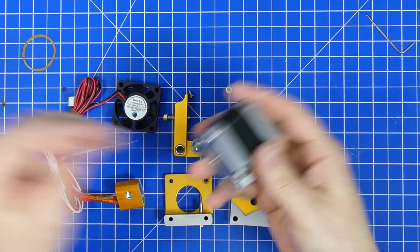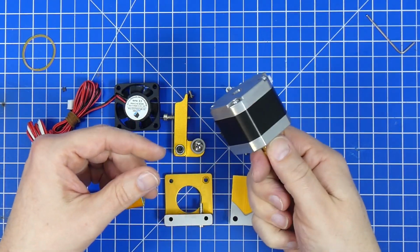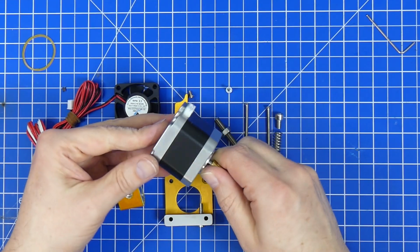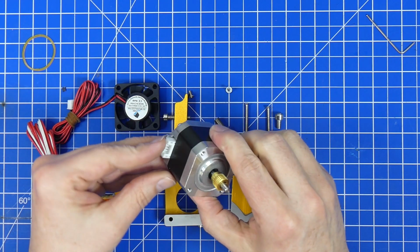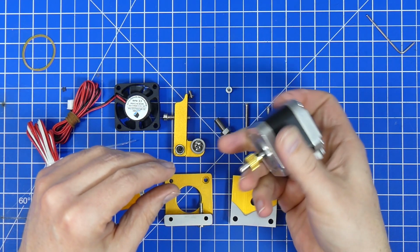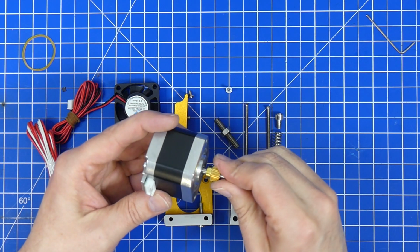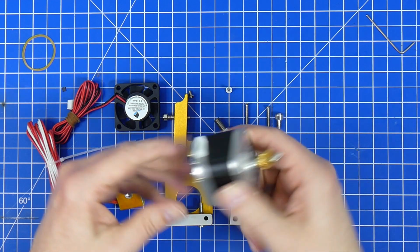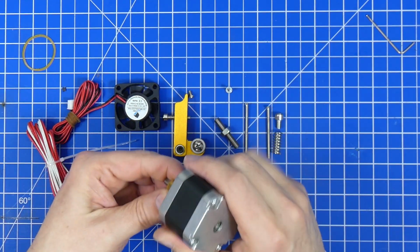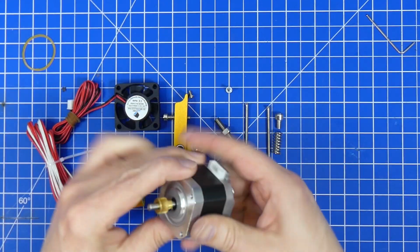By the way, for this thing here, I measured the stepper, and the stepper has a resistance of 2.1 ohms, which will put it around the 2.7 to 3.5 volt range. And that stepper isn't really bad, but it isn't the one they advertised. But it works.